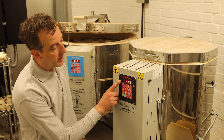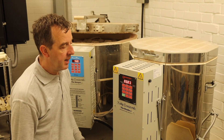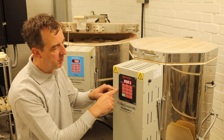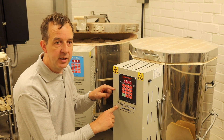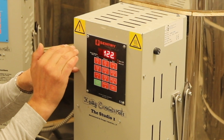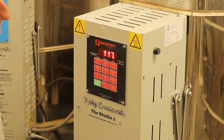That firing is now complete — you can see 'cplt'. The reason we've gone up to 117 degrees rather than 100 is that 100 degrees for a kiln is nothing, and the problem when you're trying to fire quickly to a low temperature is it's like a big lorry speeding — when you tell it to stop at a certain destination, it's very difficult to do instantly. The power stops going to the elements but the temperature will just cruise past a little bit — so don't worry about that.